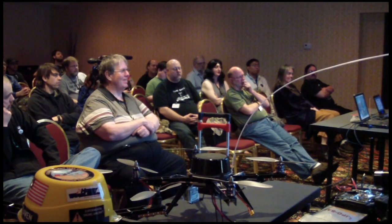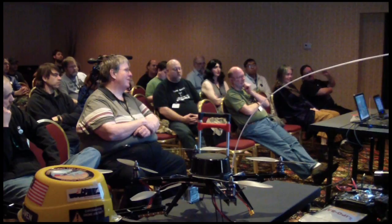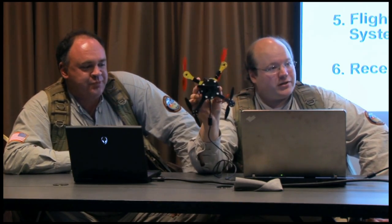Yeah. When I got there, no fire, though. Of course, you're around with the camera. I love that. Well, he told me they're like flamethrowers when these batteries go, so I'm standing back filming it. At least let's have an autopsy. And so he reaches in. Well, lithium polymer batteries react badly with sharp objects and water, and essentially what happens is they start burning. They become very, very hot, and they turn to ash almost immediately. But in that process, you get a lot of smoke, and it's why we normally use lithium polymer fireproof bags to keep them in.